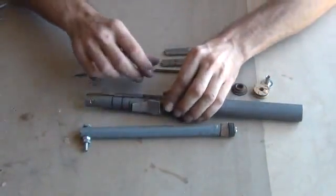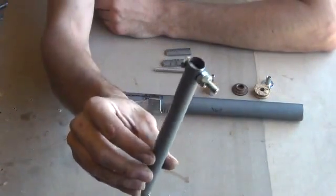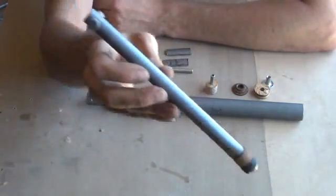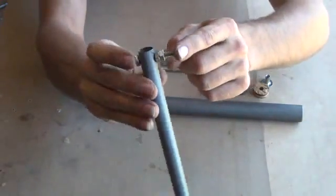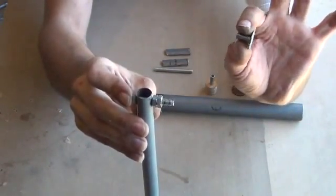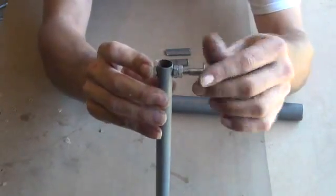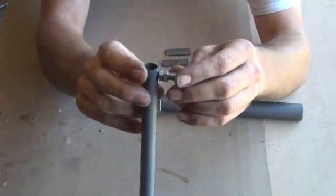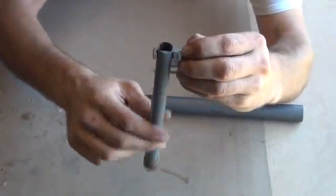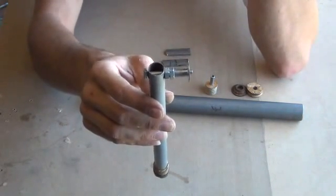The next step is mounting this to a flywheel off of our Wimshurst. I've installed a bolt through the back end of the pipe on our piston rod — that pipe is basically just the rod arm pushing up and down. This bolt goes into the flywheel. I've got a grommet piece with threads and a flange side that threads on and mounts through the flywheel with a couple of grommet washers to keep it compressed, giving us a nice rotation. Let me hook it all up onto the Wimshurst machine and show you what it looks like in motion.